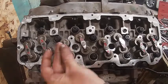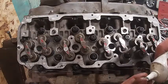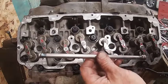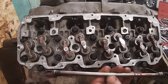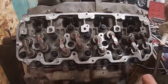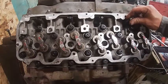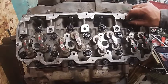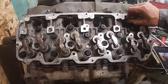I lubricated that. Same thing here - lubricate that one, lubricate that one. And here come the push tubes. First thing I do is I roll these across the bench to make sure they're straight. This is number one exhaust because I marked it. I'm going to put a bunch of oil on it. What I'm doing is I'm feeling this - when I push it down in there I can pull the lifter up and down in the bore. That tells me that things are nice and free. You create a hydraulic suction on that.